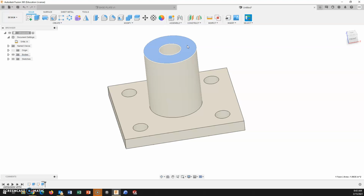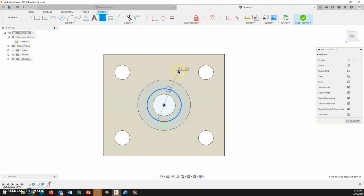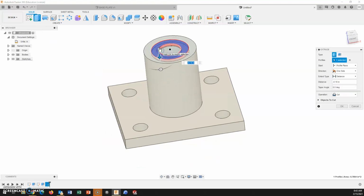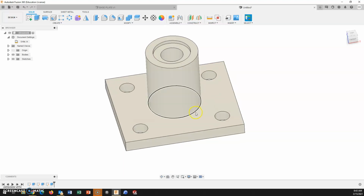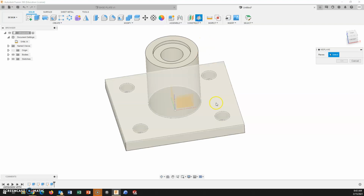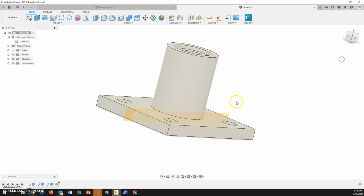I'm going to finish off the counterbore. This outside diameter is 1.25 at 0.12 depth of cut, minus 0.12. Now the ribs. Creating a plane down the middle, or I could reference the origin, because I started with my center rectangle. I could reference the origin, but I'm going to look at adding the midplane by selecting 2 opposing faces. I get a plane down the middle.